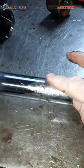That way you give the seals the best chance to actually do their job, right? Any roughness where the rod seal goes or where the wear band goes, and you're not going to get a good sealing of the rubber to metal surfaces. Yeah. So Seth's going to just spend a few minutes trying to get these looking as clean and as shiny as possible. And I'll get a bit of my emery paper.